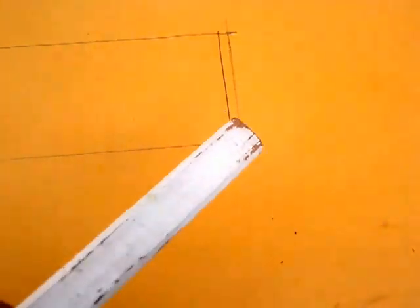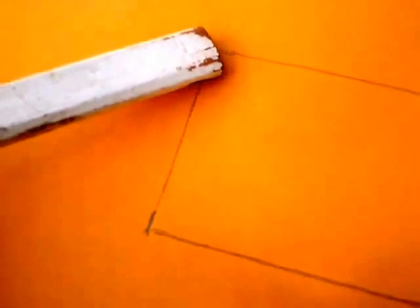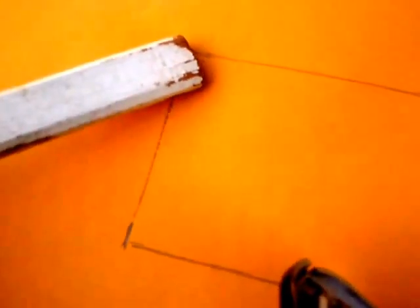That is the measurement from this point all the way up to this corner across. You measure that and you make your line wherever that lines up, because that's going to be longer because you're going on an angle. In fact, I'll tell you what that's going to be in a second. So it averaged out to 34 1/16 inch long diagonally.